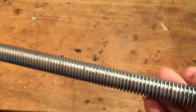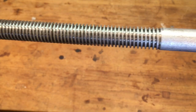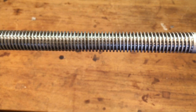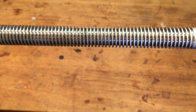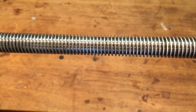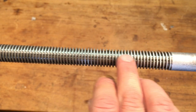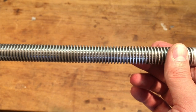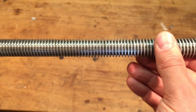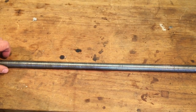In any case, this lead screw is done. I went over it to see if there's any wear — this is the part closest to the chuck, which would get the most usage. And I think there's a tiny bit of wear on the threads, but nothing too horrible. I actually thought it was worse, but it was so caked in with gunk that it made the threads look like they were worn out. But once I cleaned out in between the threads, everything looks really good. I am happy with that.